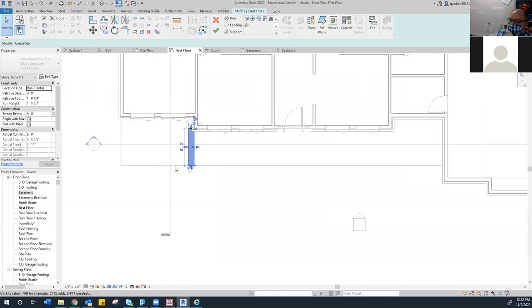All right, now if there's a step, there's typically a requirement that there's a handrail, and that's the next thing you guys want to put in here. Now, you could keep this all at the same level. There's nothing that says you can't. You just don't want to be exactly the same level as the main floor. It's got to be down just a little bit to keep water from going in there.